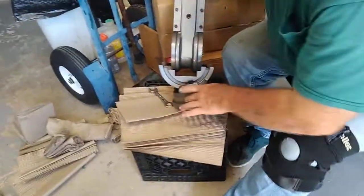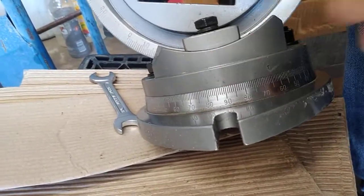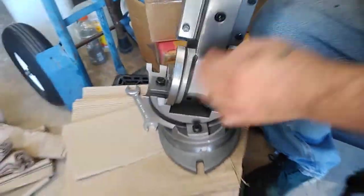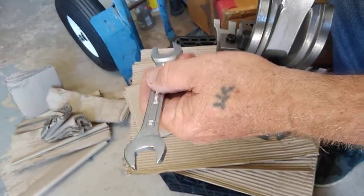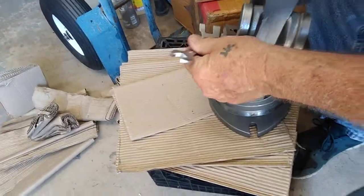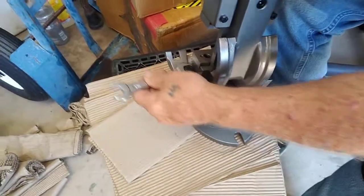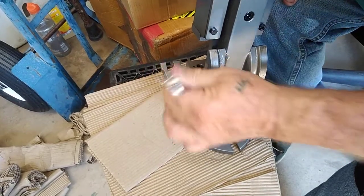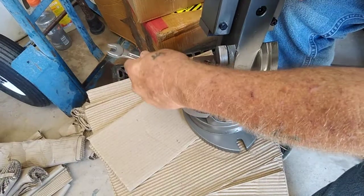Come down in here and let's show them the sine scales. They are pristine. Even me with cheater glasses, I can see these. I'm going to check this out with a sine bar. It even comes with a brand new 17mm and 16mm wrench, which we have plenty of. I'm going to change these out to Allen screws - it's just easier for me. A box end will not fit right here, and I don't like using open ends when you're snugging things.